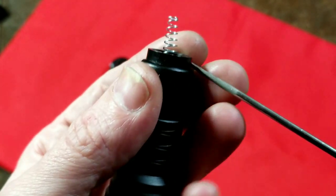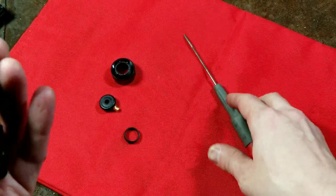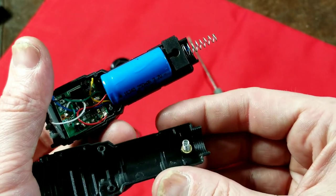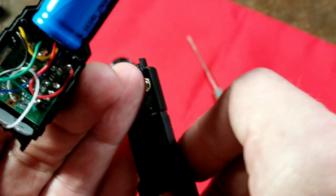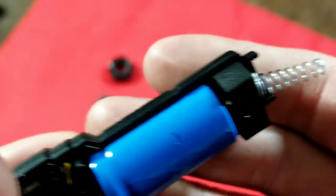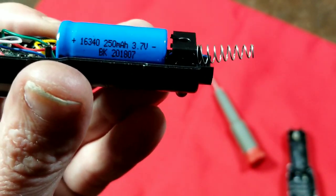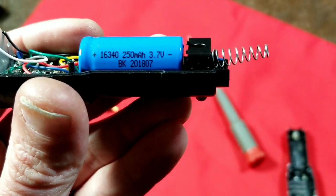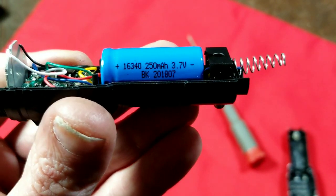After unscrewing the cap, there's a little plastic ring holding together the two halves of the clamshell. You just work it off with a small screwdriver and the two pieces come apart. Interestingly, this has two different terminals — one on each side — but only one of them is actually active. The brass piece with a spring on one side doesn't contact anything; only the terminal on the other side provides the charge. Inside we can see a 16340, 250mAh, 3.7-volt lithium ion battery. There's a part number we could look up to determine the exact chemistry — whether it's lithium ion, lithium polymer, LiFePO4, or something else.